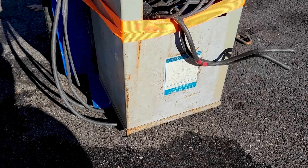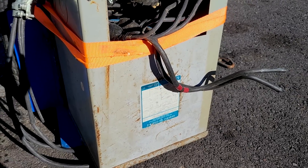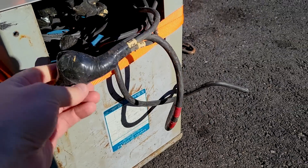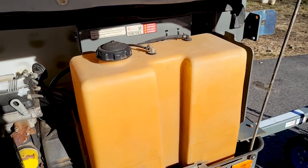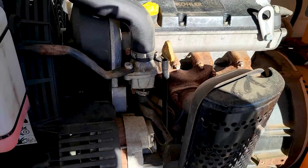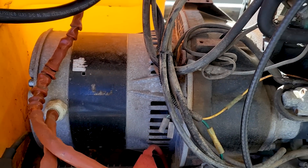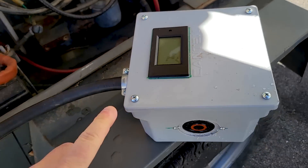Here's the isolation transformer — picked it up for only $50. It has one-to-one wiring, so the primary and secondary coils have the same number of turns. It's a nice little unit and the wires were just cut — here are the old wire nuts on it. Here's the light tower, the Wacker Neuson. Inside we have a 32-gallon fuel tank, the three-cylinder diesel engine at just about one liter capacity, and it's liquid cooled. On the other side, this is the 6kVA generator head which puts out 120 volts only. In a previous video I made this custom extension cord, and that's what we'll take apart and wire into the transformer.